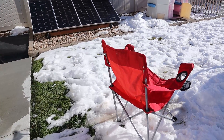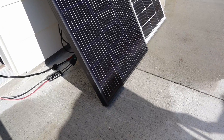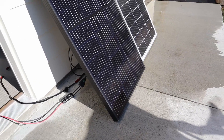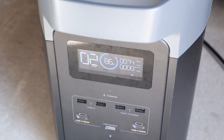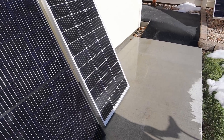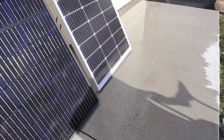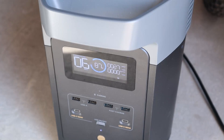For the next shading scenario, I've moved the chair so that it's just shading one solar cell in the corner of the Optivolt. With the Optivolt and one cell shaded, we're getting 74 watts charging input. Now doing the same test on the BougeRV panel with that one cell in the corner shaded — with one cell shaded on the BougeRV panel, we're getting 27 watts input.